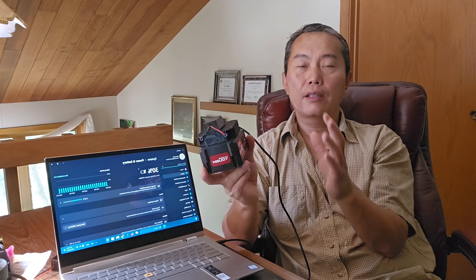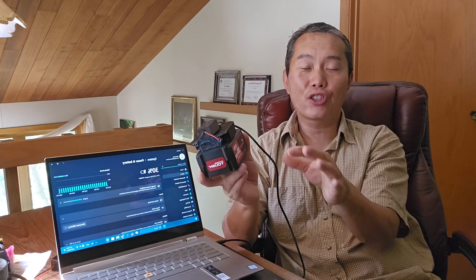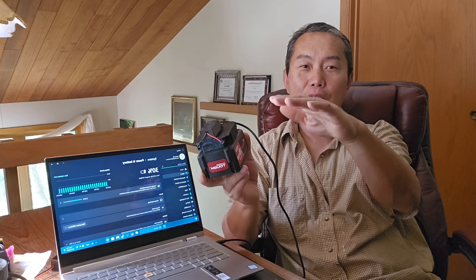To get 60 watts out — which needs 20 volts — this is a 20-volt battery that's 21 volts when fully charged. That means it can deliver 20 volts at 3 amps for a short time, not the full battery life, because voltage drops as you use the battery.